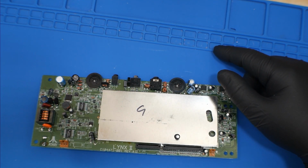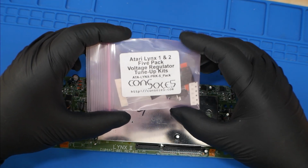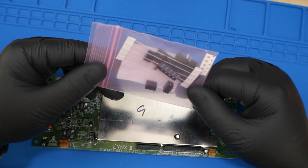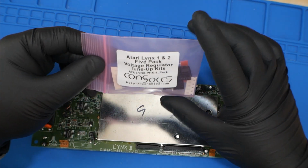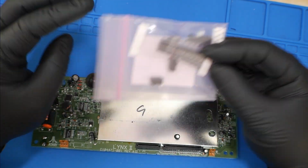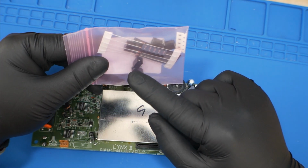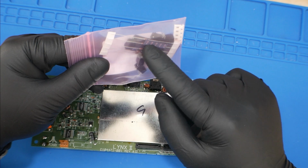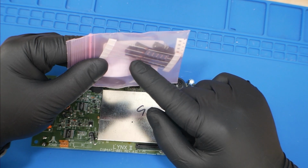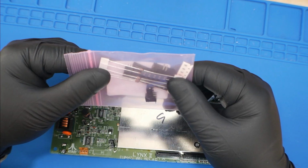And conveniently enough, if you go to Console 5, you can purchase an Atari Lynx 1 and 2 voltage regulator tune-up kit. I got the 5-pack. I purchased this. This is not sponsored by Console 5 in any way. But basically, this comes with all the parts you'll need. It comes with 2 sets of the Zener diodes, the through-hole version or an SMD version. The through-hole, I believe, is for the Atari Lynx 1 version, but you can also use it on this board, and many people do because sometimes it's easier.